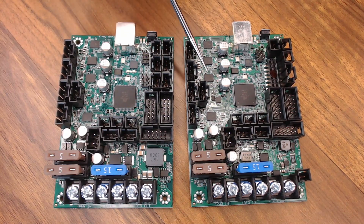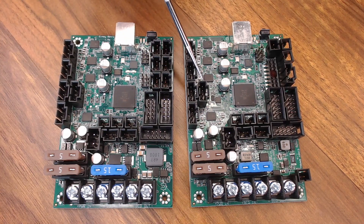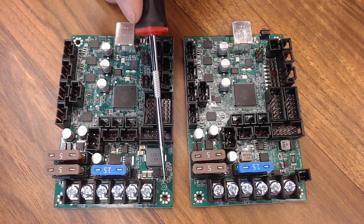It's also important to mention that these are 8-bit boards and the memory is limited. But at the current speeds of a Cartesian i3, 8-bit still works just fine — no need to go to 32-bit in that configuration. And as always with the Ultimachine boards, these are open source.